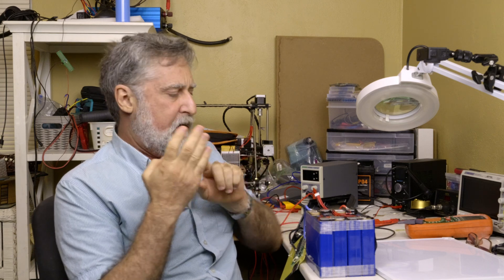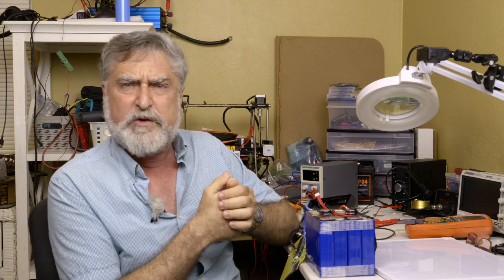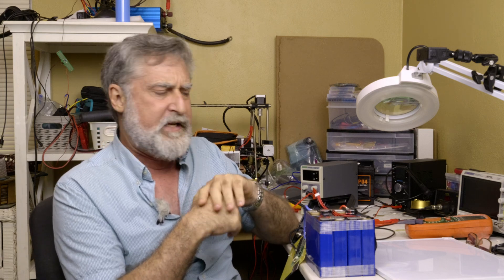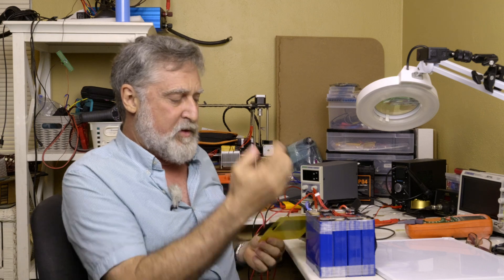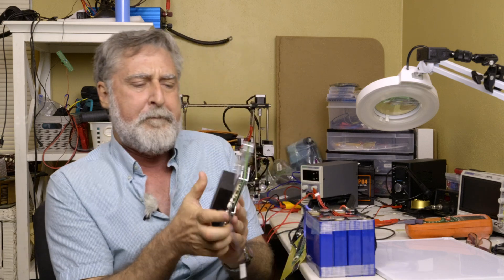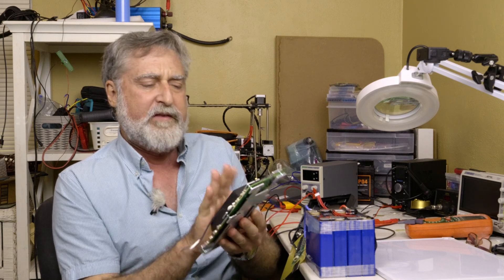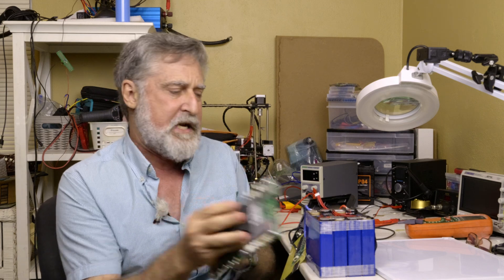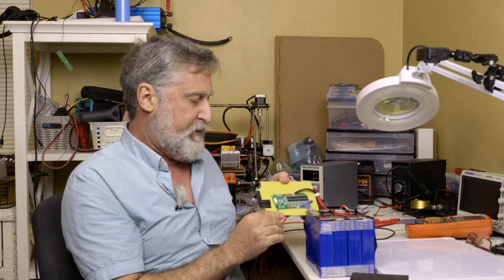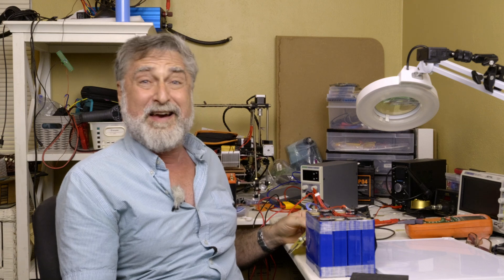Often they add a feature that says if too much power is being drawn out of them, stop them. They'll call that short circuit protection or over-amp protection. Very often all it is is when too much is drawn out, things get hot, and when things get hot, it shuts down. But the more sophisticated ones actually watch amps. If it's a digital BMS — and the best way you're going to know that is all the Bluetooth ones are digital BMS — then it's probably actually watching amps. If it's a cheap one without Bluetooth, there's a good chance it's just thermal based. As far as the base functionality, thermal kind of does the job. That's chiefly what a BMS is there for: keep the cells from destroying the cells.